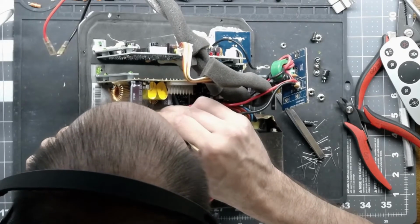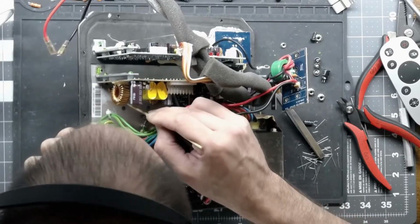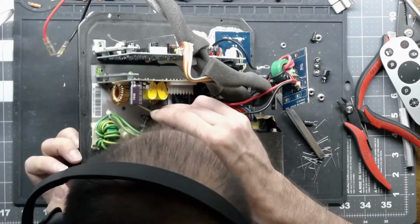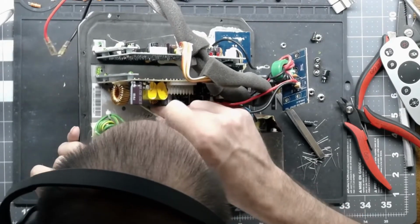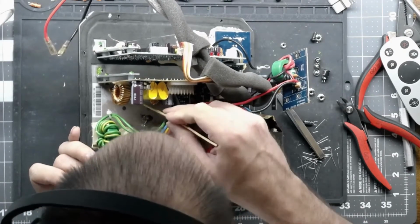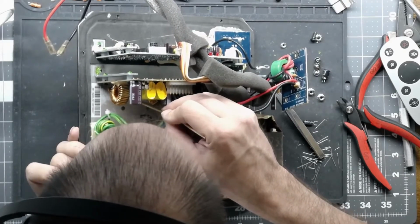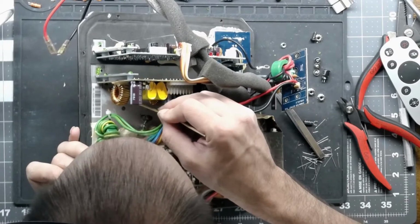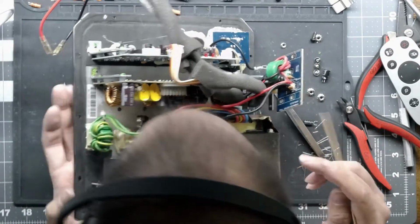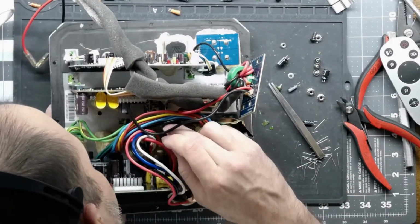And I guess it just comes with experience. You just got to know where to position those pads so they're all the way to the bottom of the device and the device isn't shorted out. And you can kind of see it if you look down in there. And I can't really show it on camera just because the angle's going to suck anyways. But get them down in there and then push the devices down a little bit to get them to stick to the pad, because you remember we put a little dab of thermal paste on each one.